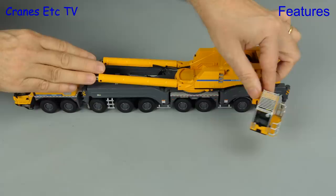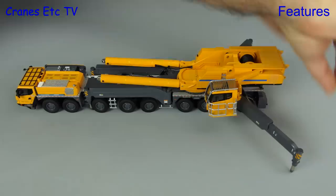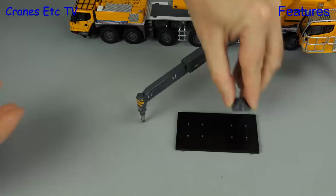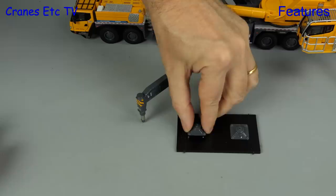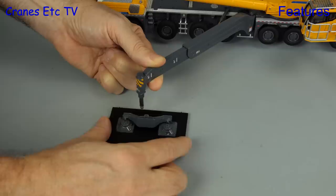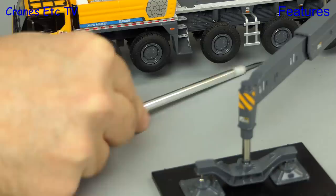The crane cab can be rotated from its transport position and then we can open up the star formation of the outriggers. They are fully metal, open easily, and can be extended telescopically. With the legs extended we add on the pads, which locate onto the spreader plates — that stops them sliding about. There's a small beam that spans between them and the pads have a magnet inside. The piston gets lowered by unscrewing it and located into the transverse beam. This is all well engineered and gives a nice secure feeling. The outriggers can support the crane wheels free while remaining straight without any bending.